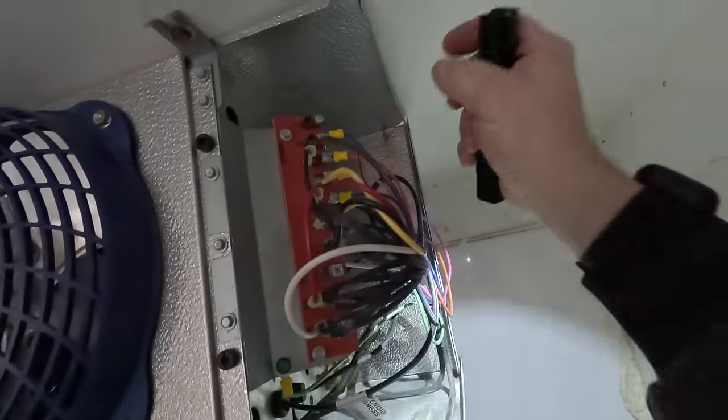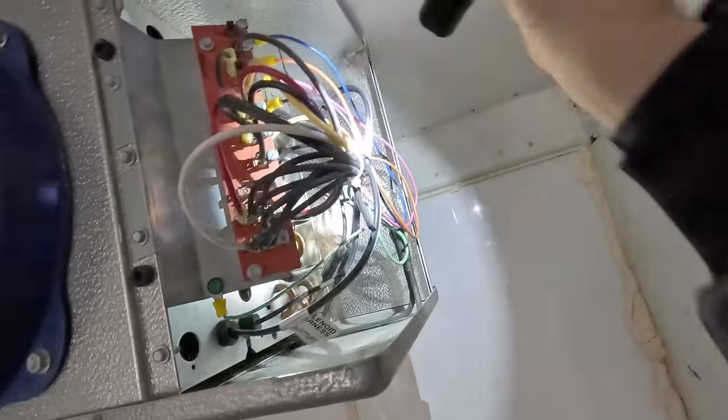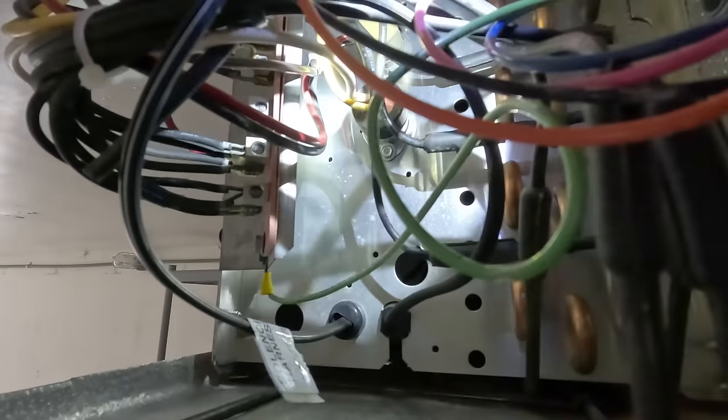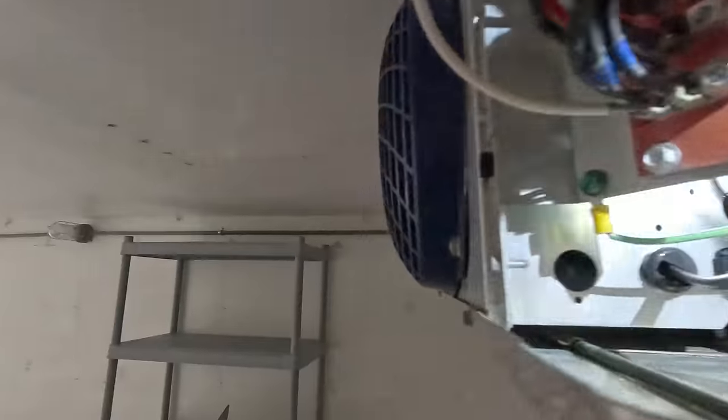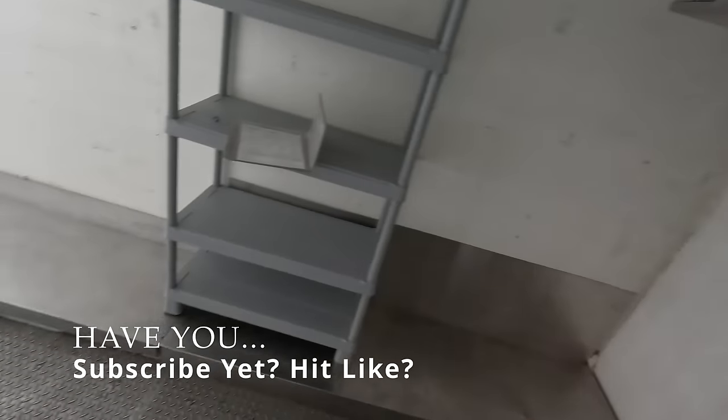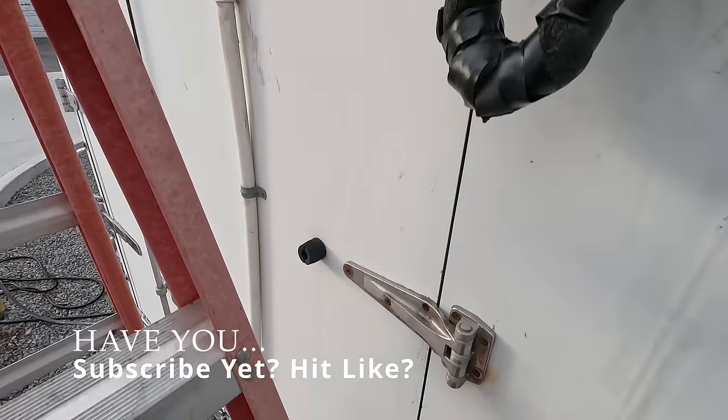It is there — on a blue wire, and the blue wire is hooked up. So we need to go up on the roof and check. We're going to change that switch. You do have a limit switch — that's the yellow and white — which loops through and keeps the heaters in the circuit as long as it's not too hot. Let's go up and see what we can find.